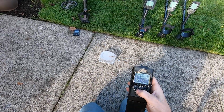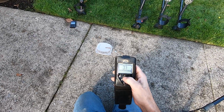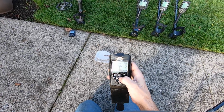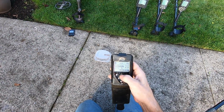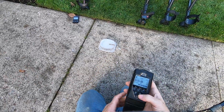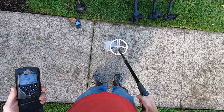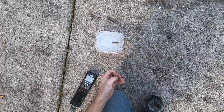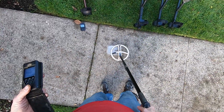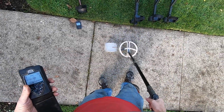Okay, let's start out in Goldfield program, right? Gold 1. So here the EMI, it is on the concrete, but all 31 kilohertz frequency, and I'll go with 2.5 recovery speed. Never mind all the EMI right now, because it's on the concrete, right? IAR at 5 here, right? To reject that iron right there. If I don't reject the iron, it won't hit these targets, right? Listen to these nails here, right? This is pretty amazing what this ORX can do. But the EMI, see, you hear all the EMI? I just encounter a lot of EMI with the ORX, man, a lot. Spanking it out, right?